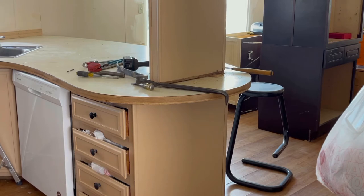This is where you're going to find your screws on a floating cabinet or a drop-down cabinet that's not mounted to the ceiling. If it was mounted to the ceiling, the fasteners would be inside. Earlier in the video I showed you that they were inside. Now what's holding this up are the fasteners down there that are concealed to this plywood.